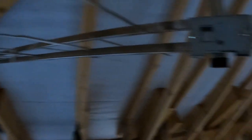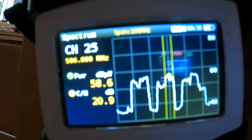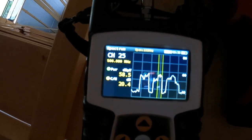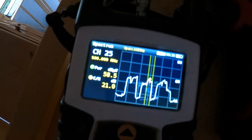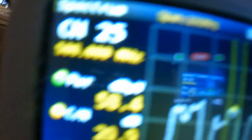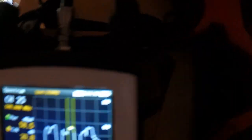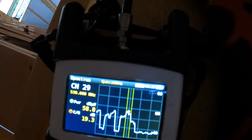I've connected my meter to the aerial, which is lined up there, connected it to the test cable onto my meter, and I've got my readings there. That's fine. The cable's going to come from that to the distribution amplifier, bringing it up to the acceptable levels, because it's a little bit low. The carrier noise is a bit low, and the signal strength itself is a bit low. But I'll be fine once I've put the amplifier through it.